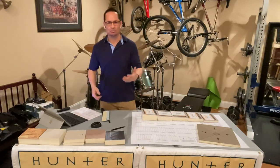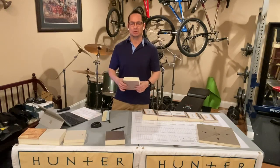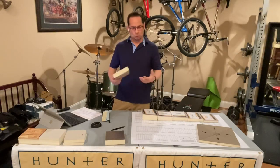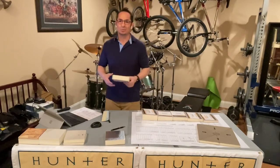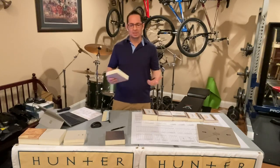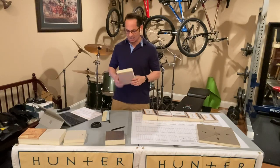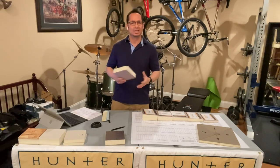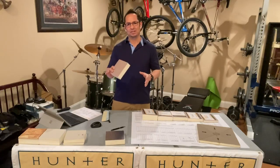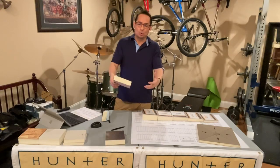So glass reinforced felt. That is going to be your standard polyiso. Can get it pretty much every day of the week. Distributors that stock this. It is not really a special order item unless it is a different thickness, or if you have a large quantity, most distributors should have this in stock. This is your standard polyiso. It can come in 1 inch all the way up to 4.5 inches. You can even get half inch polyiso. 20 PSI is your standard. You can go 25 PSI.